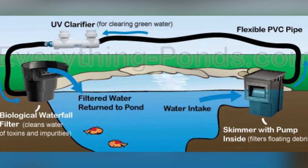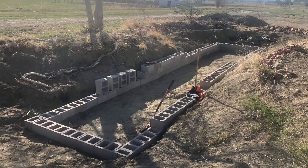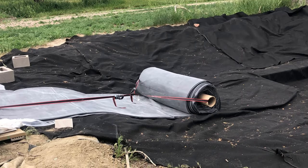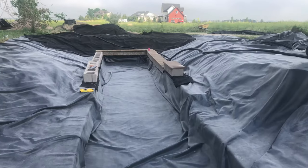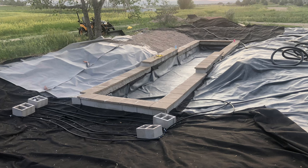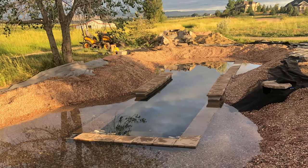You can see here as we start building out the walls. After the walls are built, we brought in the liner — and we probably overdid it when it came to the pond liner and underlayment. I went with 60 mil EPDM pond liner, which is the heaviest commercial grade liner you can get. We installed that over a heavy mesh pond underlayment, then put another layer of that underlayment over top of the EPDM liner, between the liner and the gravel, to protect it from sharp objects and from the sun. You can see as we start putting gravel and water into the pond, it's really starting to come together.